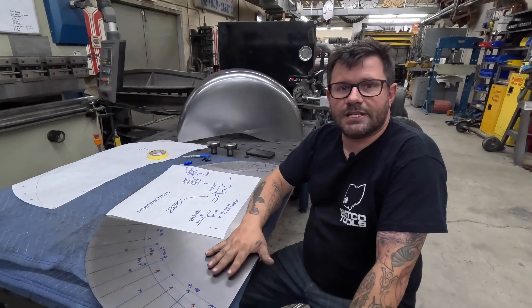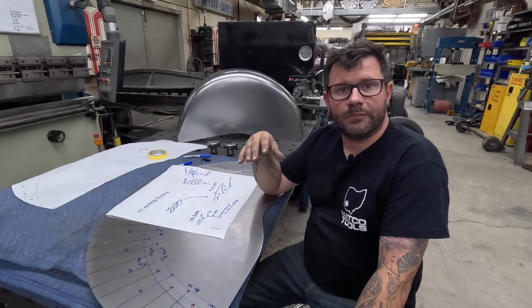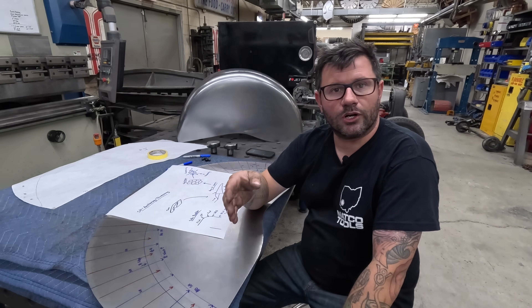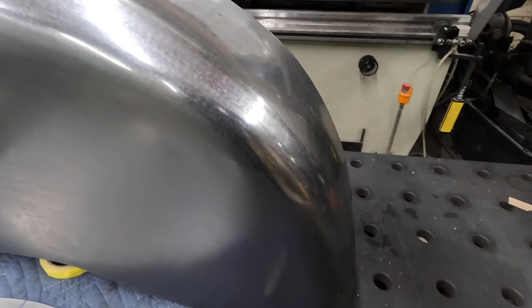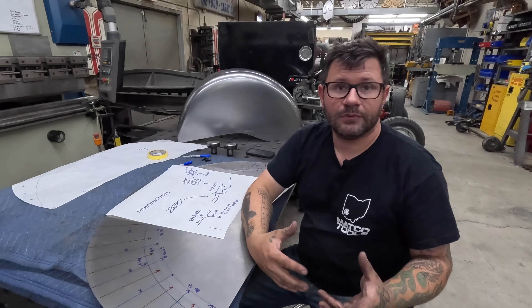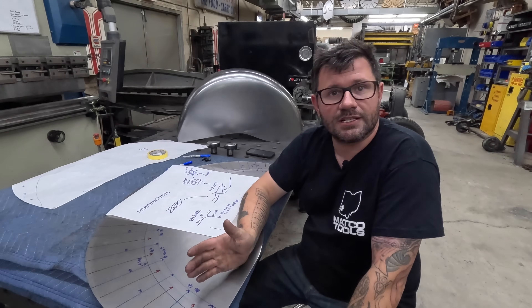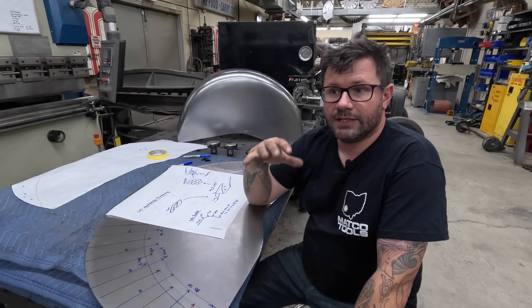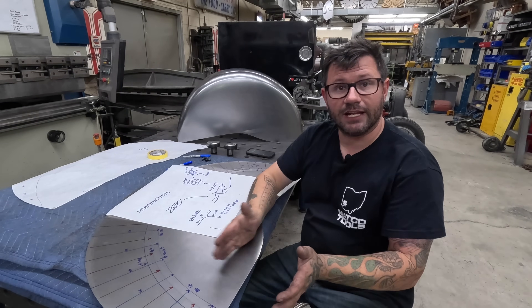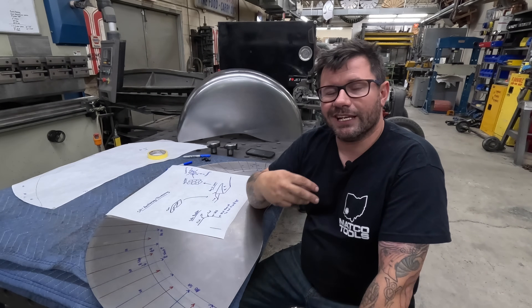Welcome back. The other day I posted some pictures on Instagram of this wheel well behind me that I made in one piece. I had shrunk the top over about seven inches deep and have about a one inch radius in the corner. A bunch of people hoped I had recorded it, so since I have the mirror part still to make, this is a good time to talk about shrinking and power hammer use of shrinking in more detail.